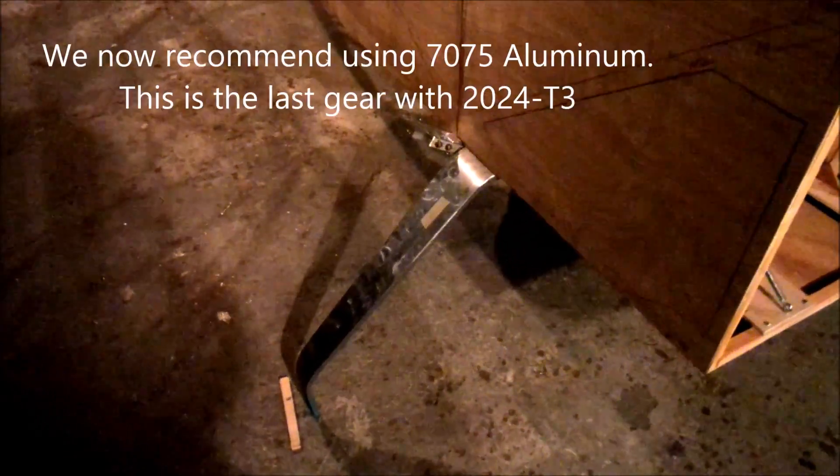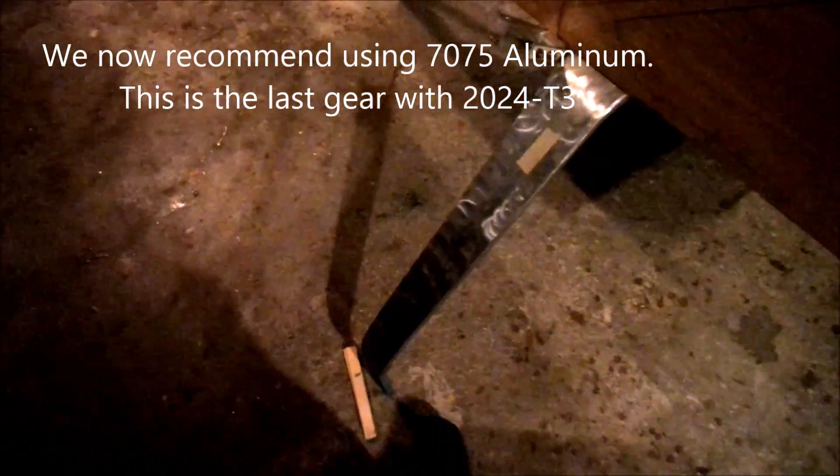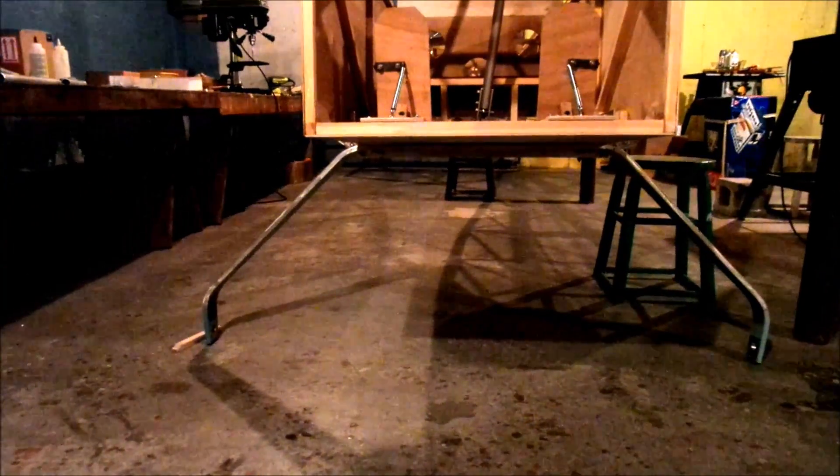You can clearly see the stick and the rudder pedals. We don't have the wings mounted on the airplane yet, though the wings are completed and we'll look at those in a second. We have the bent gear slab — this is the one made out of 2024 aluminum, four inches wide, tapered down to two inches at the bottom. The paint on the edge was just used when we were locating the flanges.